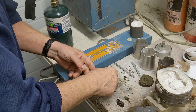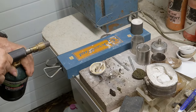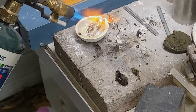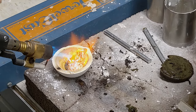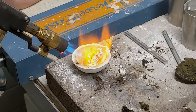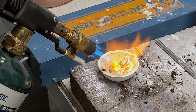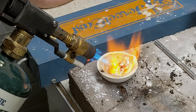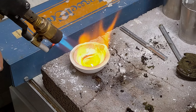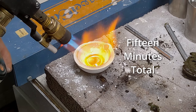Now comes the fun. We want to make a button that would fit in the cavity. And this whole procedure is called the lost wax process, so it's slowly starting to melt and ball up. This is pure silver. That has a melting temperature of above 2,000? About 1,900. There — it's starting to roll on the surface a little. And we got our button.